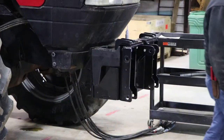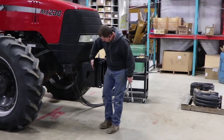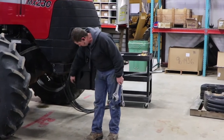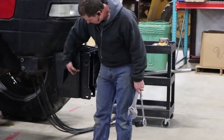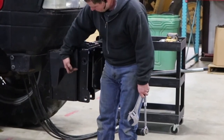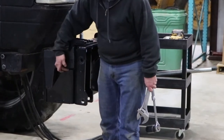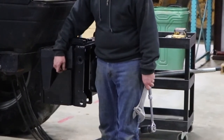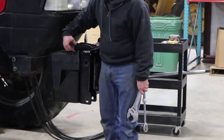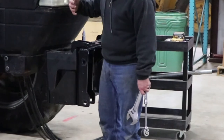One thing I'd like to mention is these are pretty much the same design on every tractor. It's going to lock in under our weight bracket here and keep this from jumping up off of our top hook. So it's very important — you'll have a little bit of gap there, but it's very important to not have a one-inch gap where that can jump up off there and fall off the tractor.